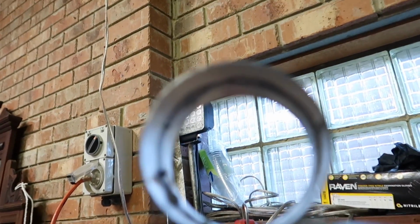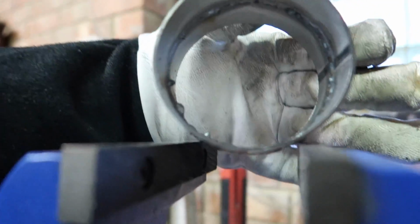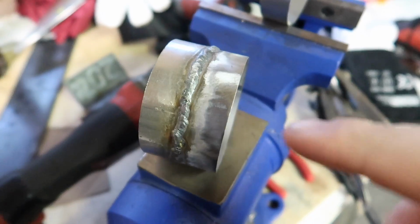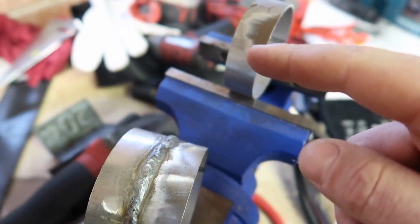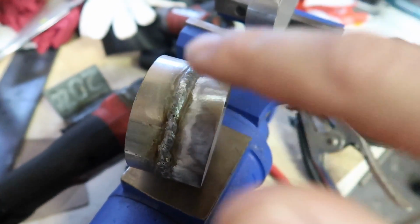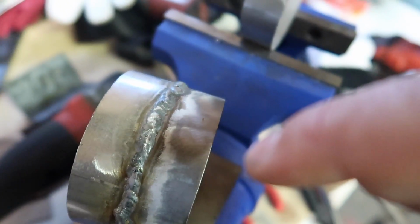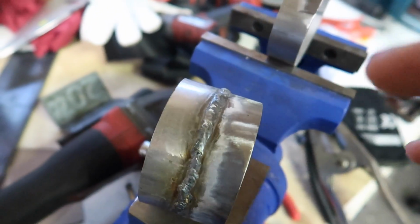And if you have a look in here, if it's going to focus, it hasn't pushed the weld all the way through, where it has done down here and along here. This pipe has a coating, I think they call it an aluminized coating, something like that. So it's dipped in something with a protective coating. On this one I did grind it back a bit, but not all the way like I've done on this edge here. So maybe that coating was also interfering with my welding.